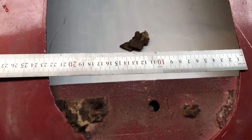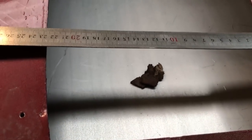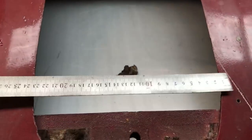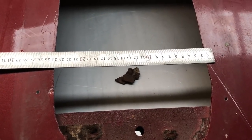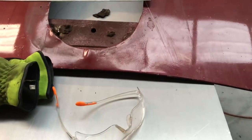Back here it's about 230mm. I need to factor in that if I cut this exactly at 230, by the time I've put these bends in it won't be 230 wide anymore. So I'm going to go with 250 - give myself plenty of meat. I'll do it at 250, which I might even go 260, just to be sure. So 500 by 250. A lot of the times I'll write that down, but normally I just scribble it on the piece of metal I'm going to cut.